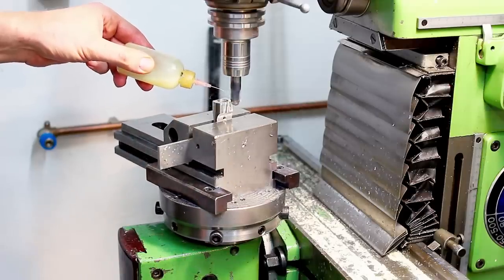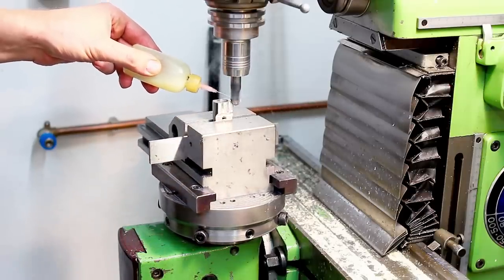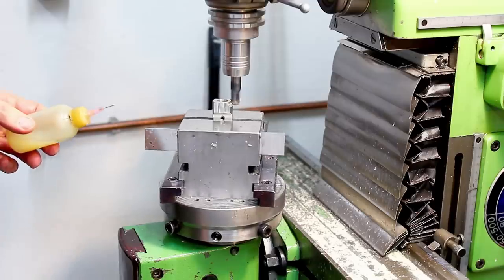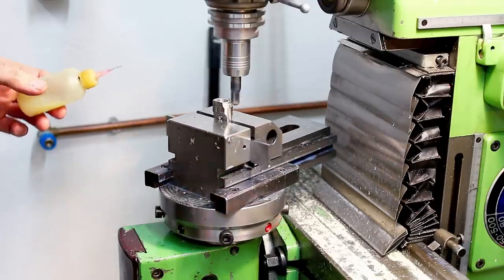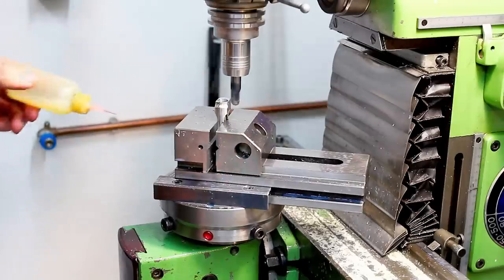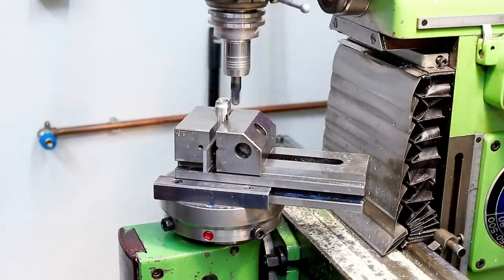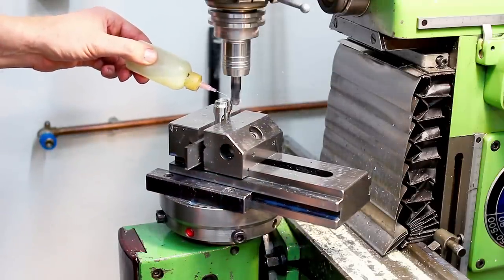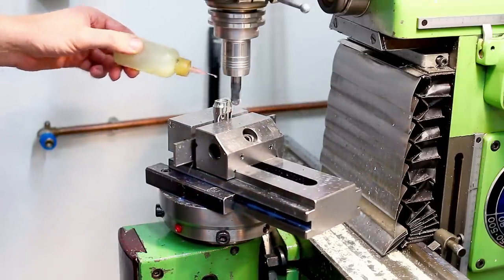So at this point my video documentation unfortunately falls apart completely because I was running out of time on this project and I needed to ship them before Christmas. Deadline problem. So here you see me using a 12mm carbide ball end mill and I'm cutting the concave radius on the back end of the part